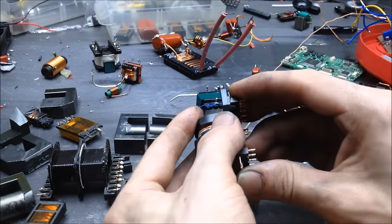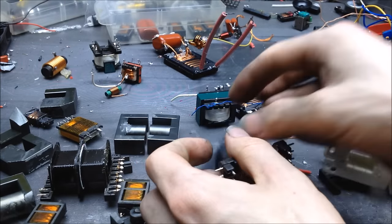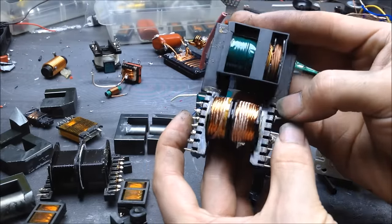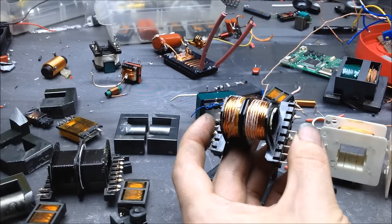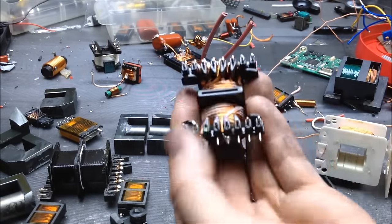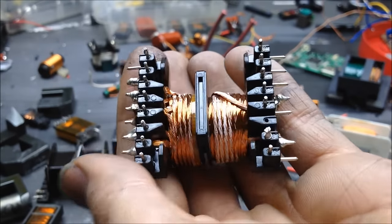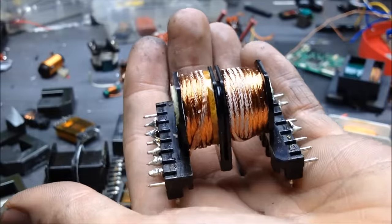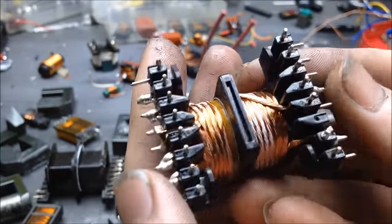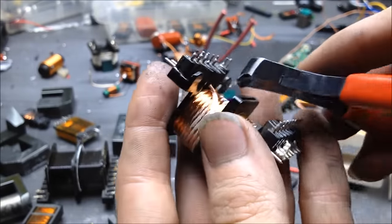As I said, a little bit of a smaller transformer. I was hoping to go for a 500 watt transformer. So a little bit bigger of a core, but this probably will do about 300 watts, 250 watts about. You can see there's a bit of Litz wire on here already. Of course, this is in the wrong configuration for a step-down transformer. We've got three coils on one side, and now we've got one coil on the other. It's really good Litz wire, though, so I'm going to try to save a bunch of that wire so I can use it for other projects.